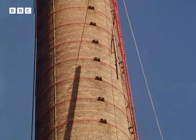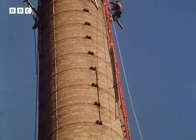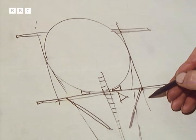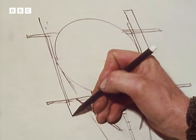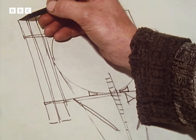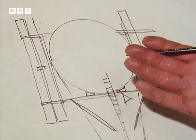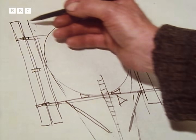After we've got the two bands on and bolted together, the next stage is planks which form the platform that you walk on. They come up one at a time — some of them 16 or 18 feet long. When a plank arrives at the top, it's tied on in a special way so that when I untie it, I can get one plank across there, then another one next to it, all the way around the top. Two iron plates with a bolt through the middle make two boards as one, and iron hooks hook them onto the battens. So the wind can blow at 100 miles an hour and they'll still be there in the morning.